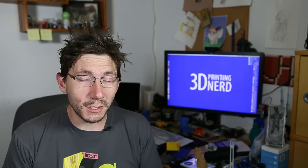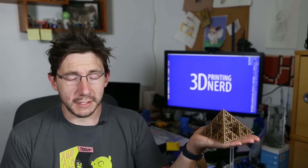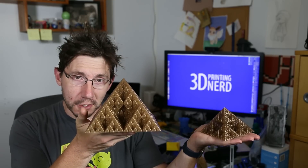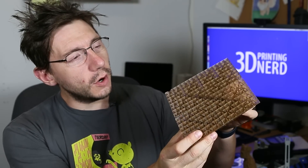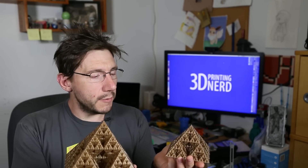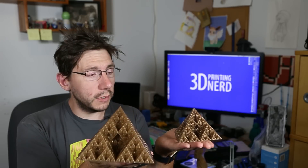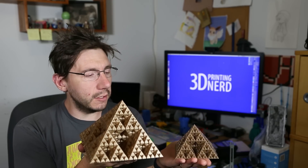With the GMAX printer I still had some filament left on that roll, so this one was sized 400% of the model's original size. This one is 600%, and it's so much bigger, and I love it just as much. Look — there are no bottom layers, so it's one continuous line of filament in vase mode, so this stuff all moves around, and it's light and it looks cool. I know I've already done a video on this fractal pyramid, but there are a couple of reasons why I'm doing this one. It's because I did have that Proto Pasta filament still on the GMAX printer, and I thought I could print some pyramids in spiral mode and see how they look, and again, they did turn out really well.